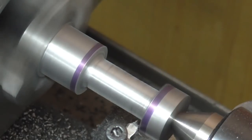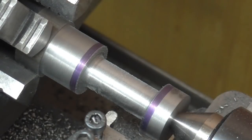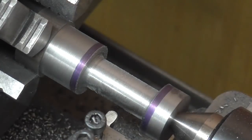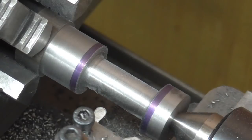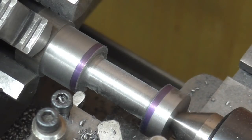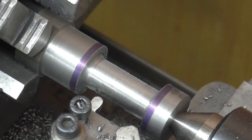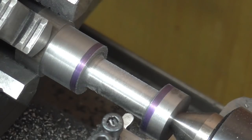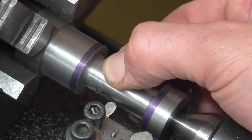I did a little explanation on roughing out using a round nose tool with the camera switched off — not a method I'd recommend. What I discussed was the fact that even with a relatively small radius like this, chatter can still be a problem. So when plunging in, rather than just doing a radial plunge, I tend to do a bit of a zigzag — moving both the cross slide and the saddle at the same time, feed over to one side, and as soon as you get to the line, back in again. It just helps stop chatter developing.